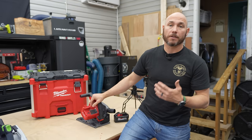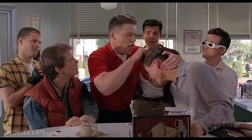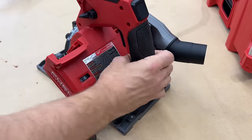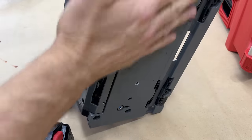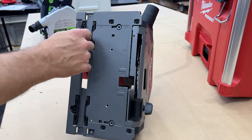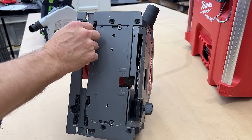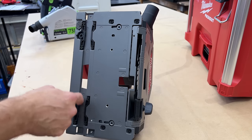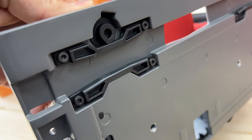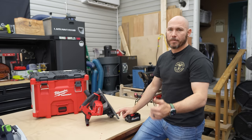The overall fit and finish of the saw is awesome. The outer shroud is some type of aluminum material — it's metal. The rest is pretty much plastic and rubbery grips. The base plate is also that same aluminum material. It's a very well-made tool. On the bottom there's a cam; the knob on top turns and twists the cam to adjust the bar on the outermost side — that tightens and loosens it on the track. You want it just snug enough that it's not wiggling, but don't over-tighten or it'll be hard to push.